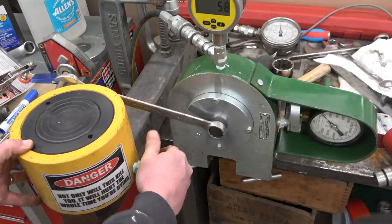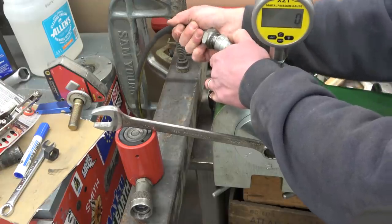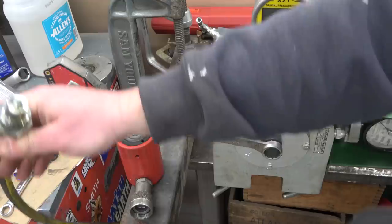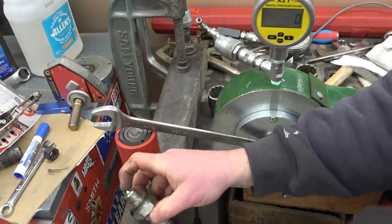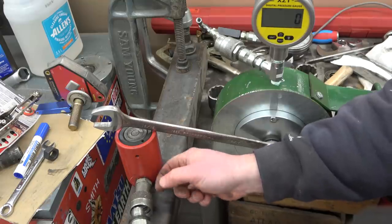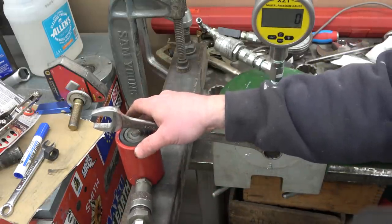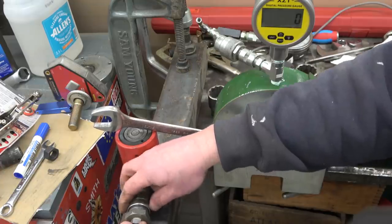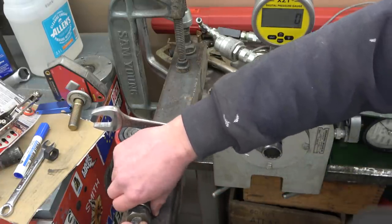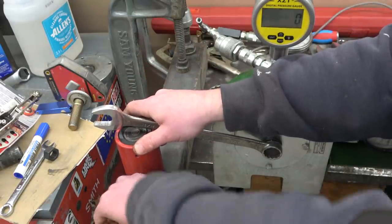Product placement being what it is, what we're using is an Enerpac pump. It's a hydraulic pump, manual. And it's got the quick couplers here, just with a check ball in there. You seat the two check balls together and it opens it up. These invariably get right full of schmoo and then fuck the seals up and so forth, but for the 4 times a year you got to use it, well worth the price of admission.